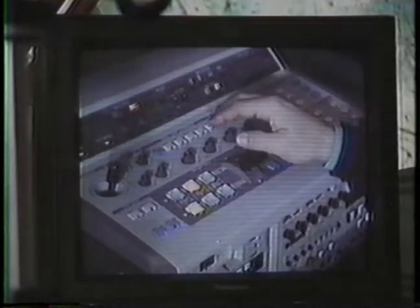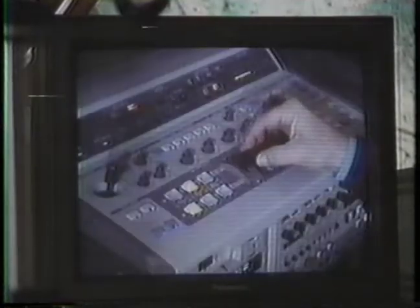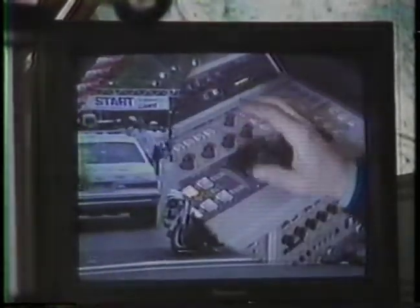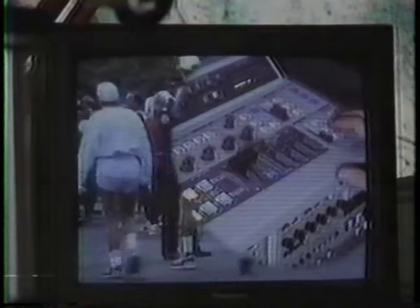As well as the picture manipulation, the unit is a conventional switcher and does conventional switcher things like dissolving from source to source. The frame store is helping to synchronize these two images, and it will also wipe. As well as these two sources, we've managed to genlock our computer for graphics, and the machine will allow us to add that extra synchronous source as a title over the rest of the picture.